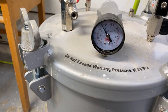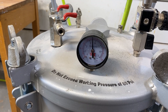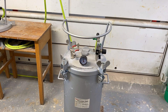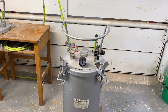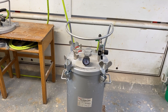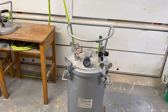You can go anywhere between 50 and 55 PSI, but we prefer around 52. Whatever you do, don't go over 55 — it doesn't do you any good and it actually gets dangerous, especially if you're doing what a lot of people do, which is modifying a pressure paint pot from Harbor Freight or somewhere like that. Those are perfectly fine; you just don't want to over-pressurize them. You can actually pressure cast and do a decent job down in the 40-pound range, but we prefer 52. Now that it's pressurized, we're going to let it sit for about five minutes, then come back in five to ten minutes and pull it out of the pot.